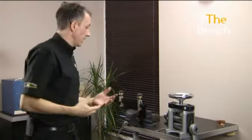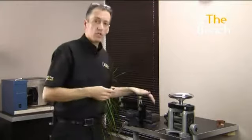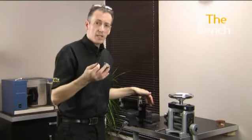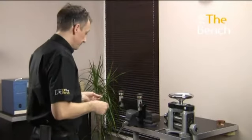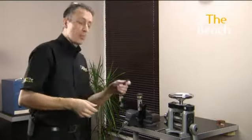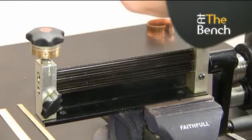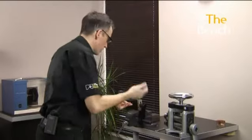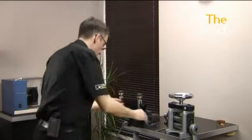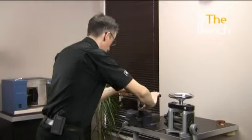We're using some copper today — I think this is 0.3 of a millimetre copper. The advantage of using a corrugator is that you can get away with quite thin pieces of metal because the corrugation adds a lot of strength to the piece, which helps in this day and age with the price of precious metals. I'll loosen these approximately a quarter of a turn and set both sides to 70, then introduce the copper squarely into the corrugator so the corrugations run neatly down the piece, and take it through to the other side.